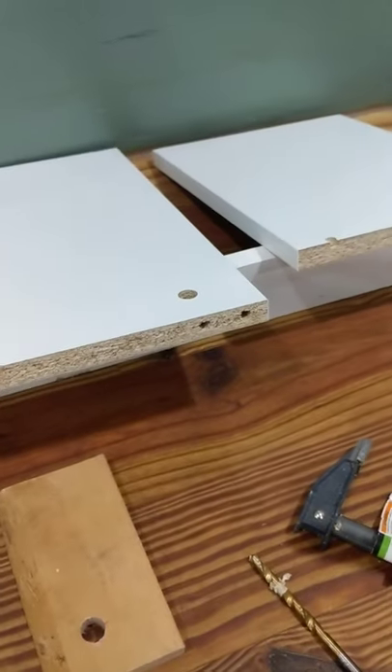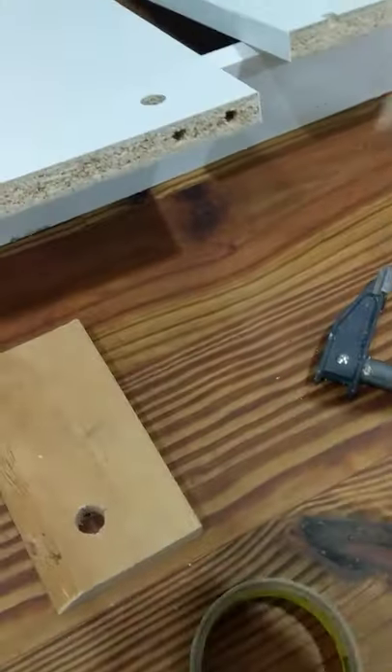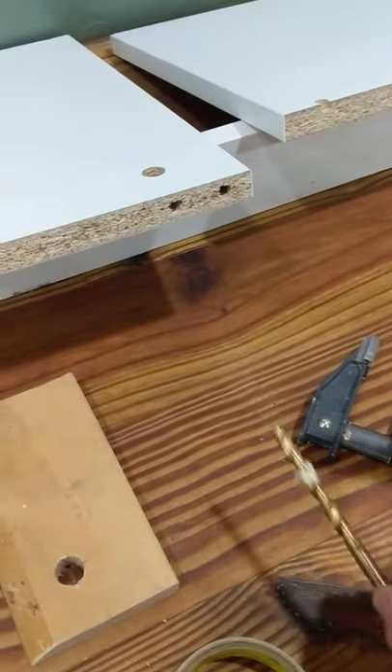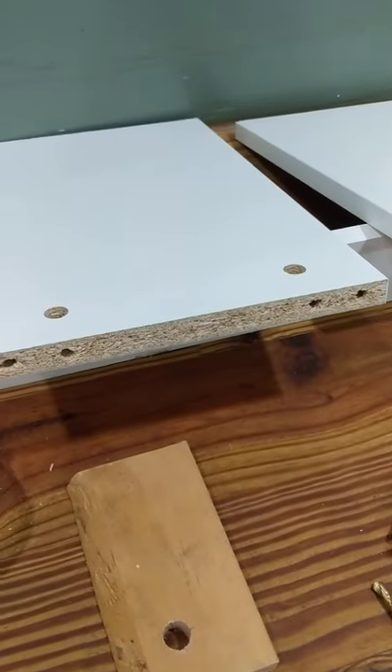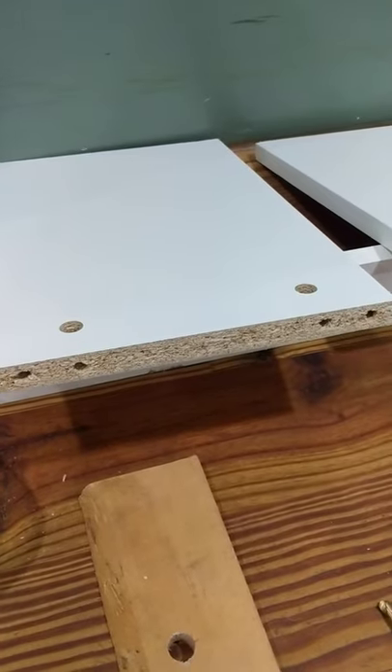I highly recommend doing that — it would have saved us a lot of time. Having the right tools from the start would have saved us too. So: 5/8-inch bit for the large holes, 19/64 for the smaller holes, and get a really good fresh sharp blade on your miter saw, and you'll be good to go to do this project. Hope y'all have a wonderful night.